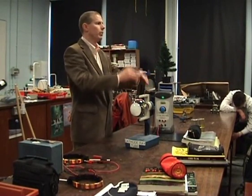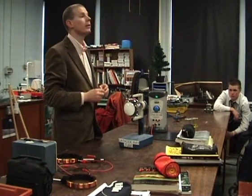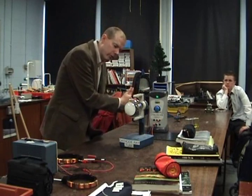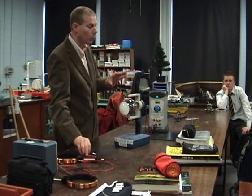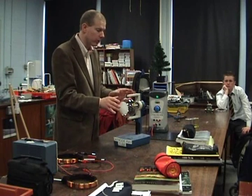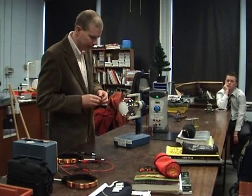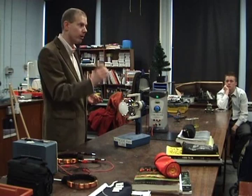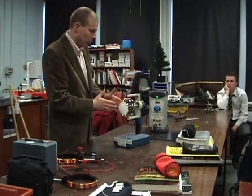As a result of that heating up, there are electrons flying off. What is the process by which electrons are fired off the top of a hot metal? Thermionic emission. So there are electrons going off in all different directions. This experiment happened over 100 years ago and was one of the experiments that verified electrons actually existed. J.J. Thomson was one of the first to carry it out and realize its significance. They had been predicted in advance by an Irish fellow called Stoney, but nobody had been able to verify that these things existed.